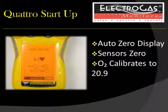Your monitor will then perform an auto zero. The oxygen sensor will be set to 20.9 and all other sensors will be set to 0. Be sure that you are in fresh air, free of other gases and toxins while performing this function.